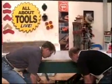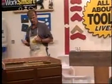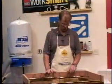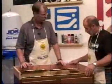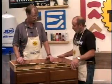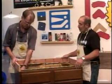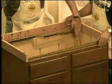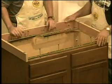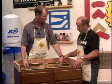Now, what we wanted to take some time to talk about is undermounting bowls. There are quite a few different ways to do it. This is one method, and it works extraordinarily well, especially with cast iron, because cast iron bowls weigh a great amount. A lot of fabricators, when they have to mount them, will typically build a framework. We used to use 2x4s and make a frame with legs that came up. Once we got the bowl in position, we would raise our framework up, pin the bowl, put the legs in, and then screw it right into the wall of the cabinet to carry it, because we wanted to make it so that if we ever had to remove the bowl, all we had to do is take the legs out, and we could get the bowl out.